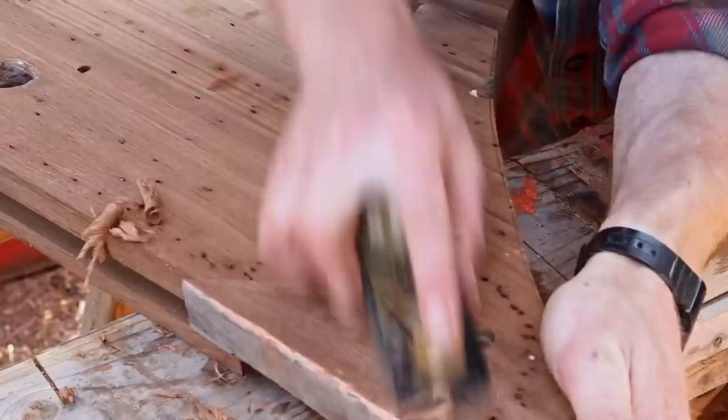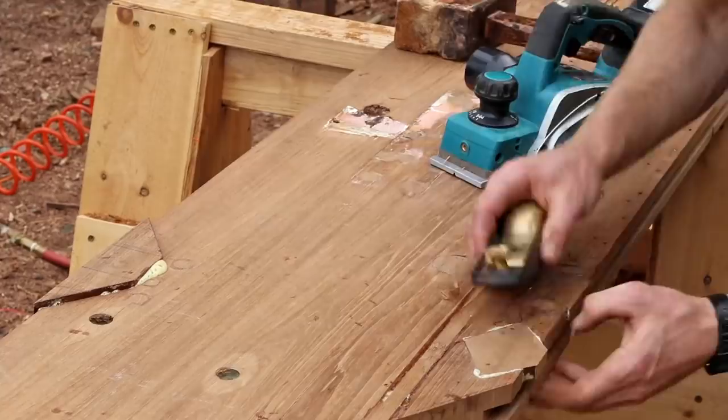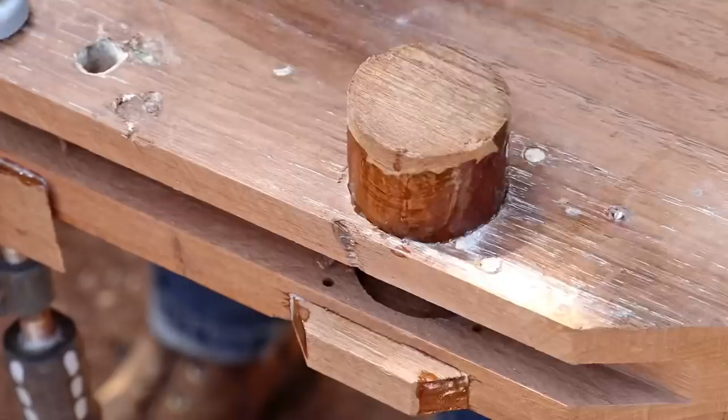So you may have noticed that I haven't used much glue in rebuilding Tally Ho so far. And that's because, in general, I prefer to rely on mechanical fastenings, which also happens to be the way that they built the boat originally, and she would have lasted pretty well if it wasn't for the ferrous metals. But when doing something like repairing the transom, there's really no other practical way than to use glue. And in these cases, there's many different glues that could be used, but the glue that I often find myself using is polyurethane glue, which there's some here.